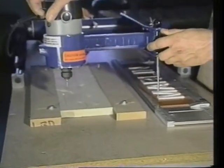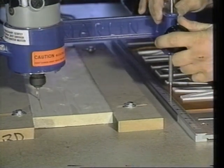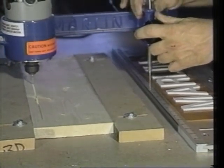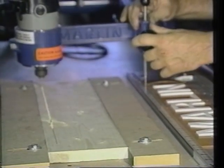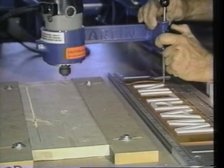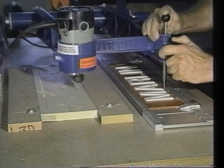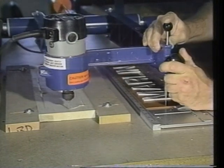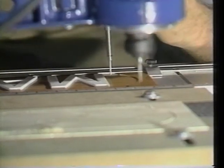When you're ready to begin, start the router motor while the router bit is still well above the work blank. Then lower the tracing stylus into the templates first, and then lower the router bit into the work blank. With the eighth inch stylus tip that matches the eighth inch router bit, guide the stylus along the outside outline of the copy holding bars and the edges of the letter templates.